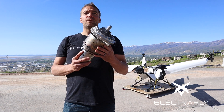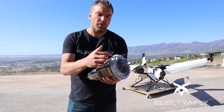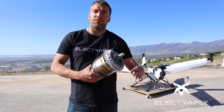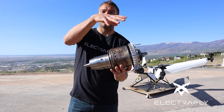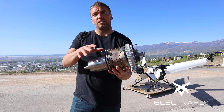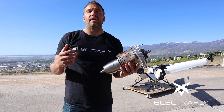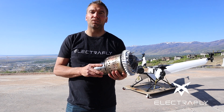The next type of engine is a turbofan, which is something you would see on an airliner. The turbofan has a second spool going through the engine and another set of blades in the back. What's important is that it has a big blade up front that blows over the casing. There would be another casing on top, and in between those two casings is an air gap where air is free to blow through. That bypass air is what differentiates a turbojet from a turbofan. It has a lot of power, it's a lot quieter, and that's why airliners like them — they're more efficient.